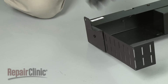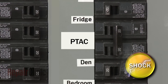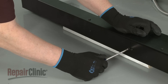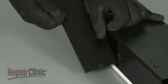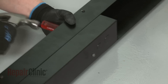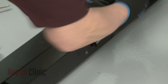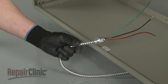If you're using a sub base with an electric receptacle, be sure to shut off the power supply before connecting the power wires. Unthread the screws to detach the junction box cover from the sub base. Remove one of the rear knockout plugs. Use an appropriately sized UL listed or CSA approved conduit connector to connect the power supply cable conduit to the junction box.